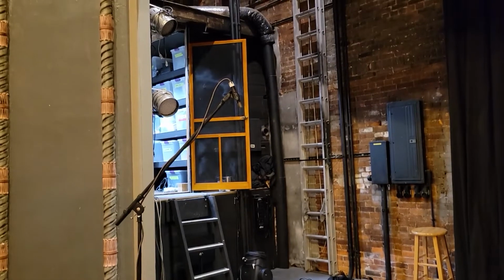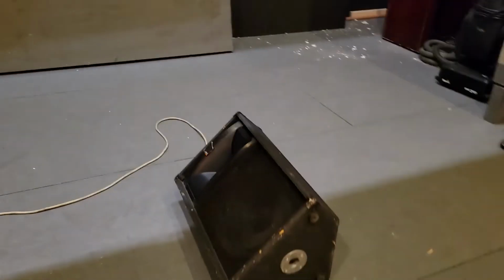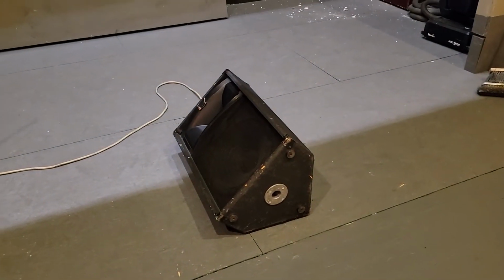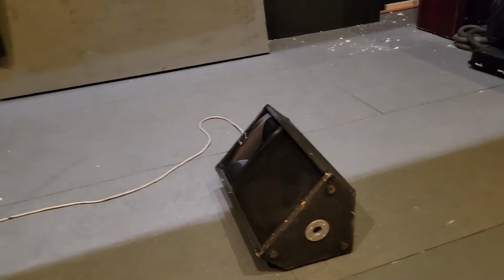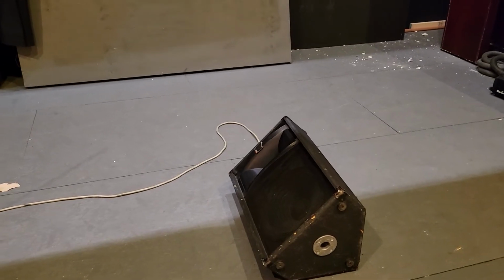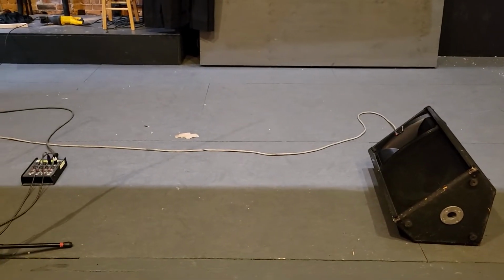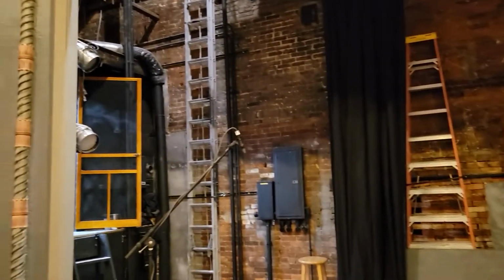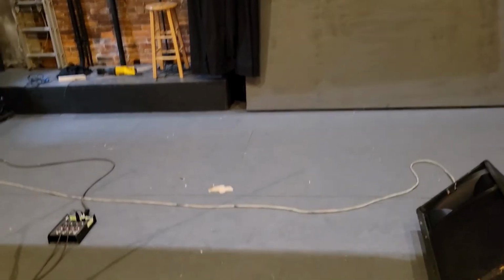but it's something where you don't want the signal from that overhead mic to be fed back through to, say, this monitor, because then the microphone starts picking up itself coming out of a speaker, and that will lead to what's called feedback. If you ever hear the loud reverb or ringing sound coming from a PA system and think, what the hell is that? It's basically sound getting looped: going in the microphone, coming back out of the speaker, back into the microphone, back out of the speaker, and it creates that phenomenon called feedback. So this microphone here definitely won't be sent into this monitor.